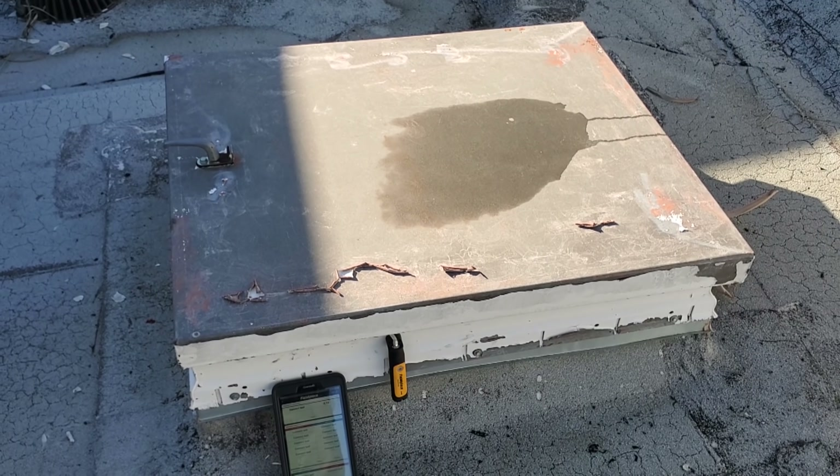It's one of those rare days in California where it's kind of frosty up on the roof. One of the ACs is not running — this one's not working at all. There's no smoke detector on the unit itself. The duct detectors are located in the ductwork down in the building. We have a test and reset station right here that is tripped — no light, no light. We're going to go ahead and reset the alarm. It's not resetting, but I was able to reset it by turning this one on and off. The unit has started up and went right into heat mode. The alarm code cleared. That's why we have test and reset stations — so we can reset them, especially when they're installed in the ductwork.